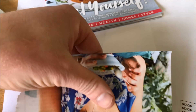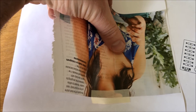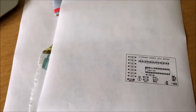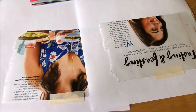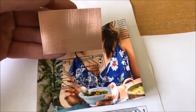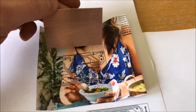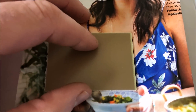We'll go ahead and place one of these over this image so we know it's going to print in the right place. We'll do the same for the silk screen layer. Clean the copper board up, get all dirt off, make sure it's nice and shiny — I just use the scotch pad. Then it's putting this face down over that image. Make sure it lines up.